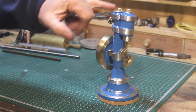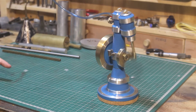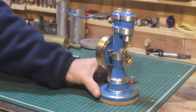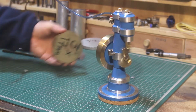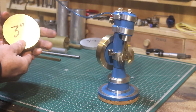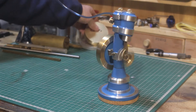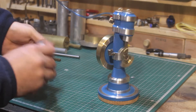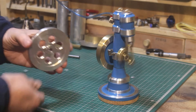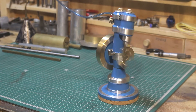That oiler plug has a small fiber washer to seal it, because that's at the top of the piston to the top of the cylinder. The flywheel was turned from a piece of three inch brass and is 15 millimeters thick. I originally planned to use an aluminium flywheel I'd made, but it was simply too light — there wasn't enough momentum to return the empty cylinder.